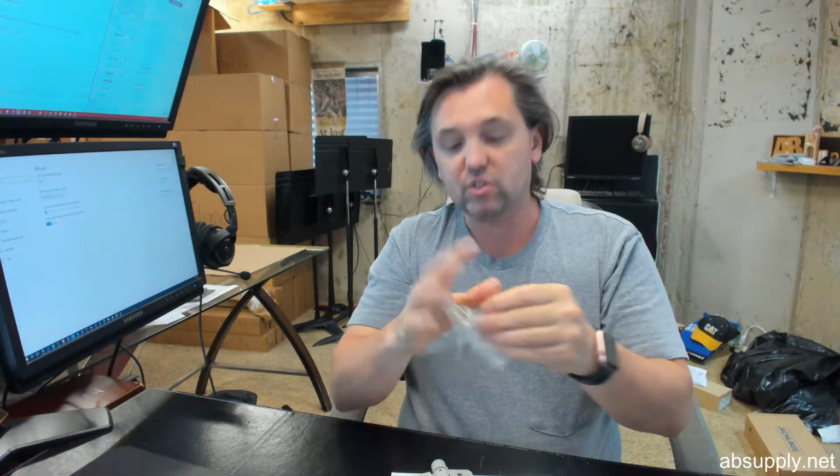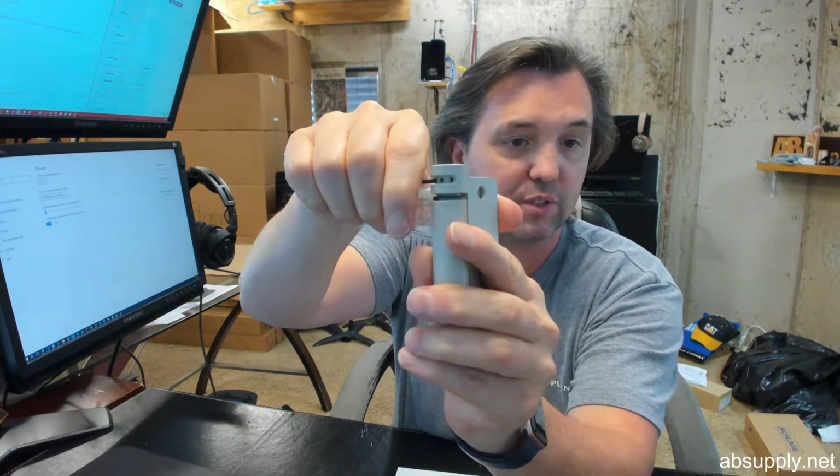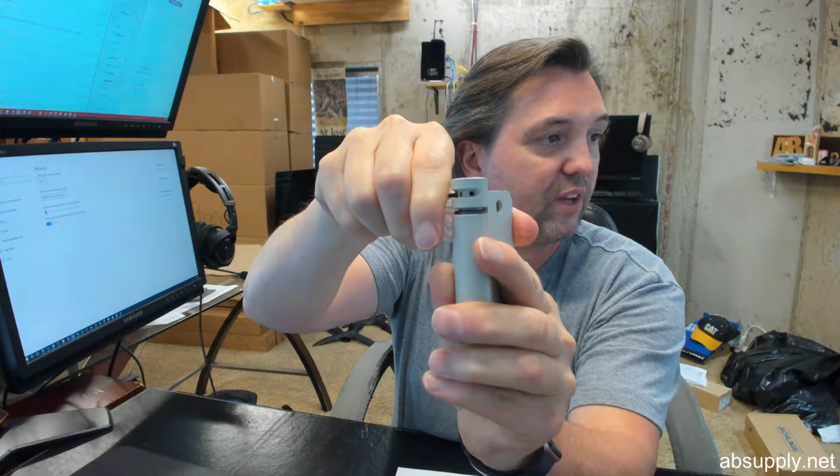When you install the hinge with the tension collar pointed towards the top, you insert the rod into one of the holes and then turn it clockwise. That will allow you to set tension on the spring and reveal new additional holes, and it's into one of those newly revealed holes that you will insert the tension pin.